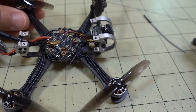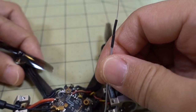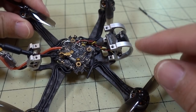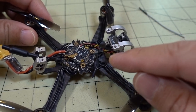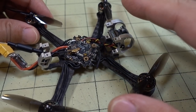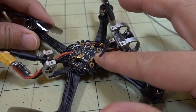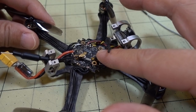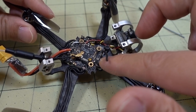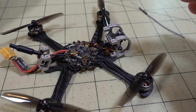I'm going to have the antenna come out of the top here, and the battery uses a little zip tie to hold it in place. The last thing I'm going to do is change the RSSI offset — so when you put the transmitter right next to the antenna it reads around 100 instead of 80. I increased it to 100 by putting an offset of 20 in the CLI. So when I'm flying close to me, you'll see it's in the 90s, which is where it should be.